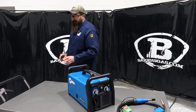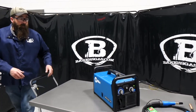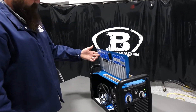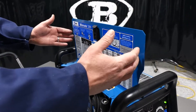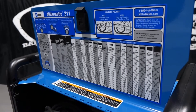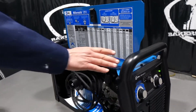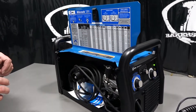If you get into heavier gauge material, you can still weld over 3/8" but you'd have to multi-pass weld that. Now, flipping the machine around, this is the access door. On the inside, Miller has a really nice sticker that gives you parameters, suggestions, and basic setup — a helpful guide if you can't remember settings or need to change metals.